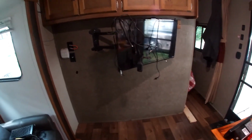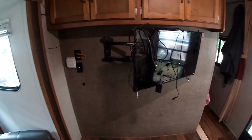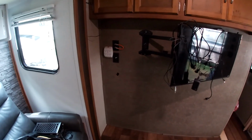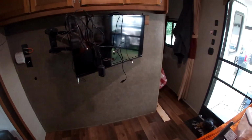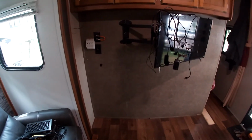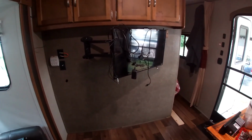The game plan on this is that the 15 and a half inch deep cabinet is going to become 12 inches deep by the time I get done. I'm going to take 3.5 to 3.25 inches off the back of it to get it to fit as far as depth goes with the slide. But you'll see how I'm going to do all that. I'll show you everything, and then if you ever need to do it, you can do it.